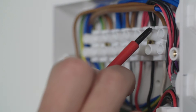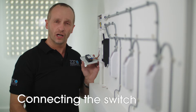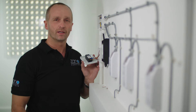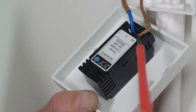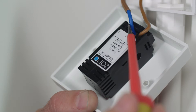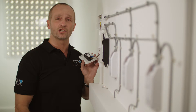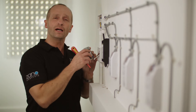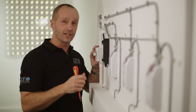So let's connect the switch. You can use grid, module, or plate mounted — Zano rotary controllers are all wired the same way. Take the brown wire and connect to the terminal labeled 6. The blue wire connects to terminal 7. Also, be absolutely sure to terminate your earth cable according to regulations. Now fix your switch back to the wall or switch box securely and safely, ensuring that all terminations are safe.